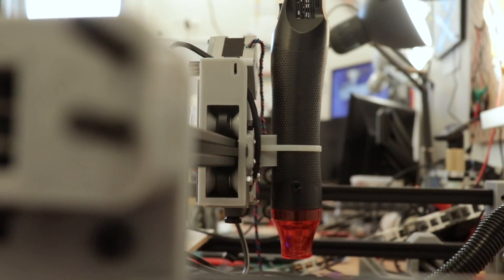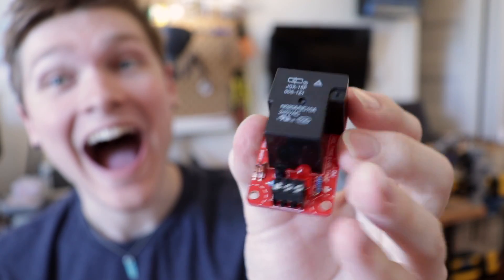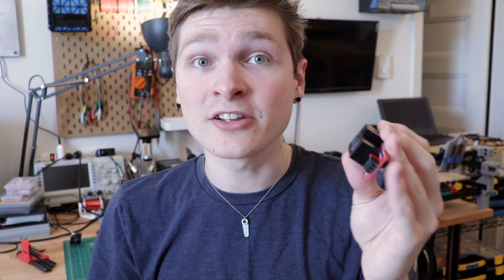The heat gun I'm going to use runs on mains. Controlling mains is super spooky, but there's an awesome thing you can buy from SparkFun called a Beefcake. The Beefcake is a universal relay module — it can switch AC voltage, DC voltage, super high current. It can control pretty much any load I'll ever have an inclination to flip on and off. So I'm going to turn this cable into a danger cable by cutting one of the wires and connecting it into the Beefcake so I can control it safely and reliably with a RAMPS board.